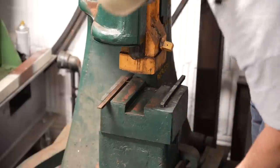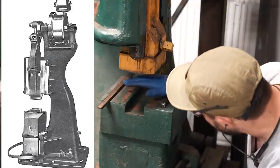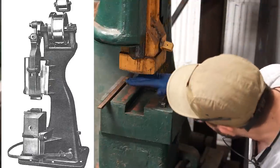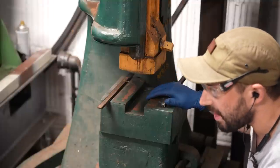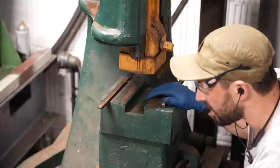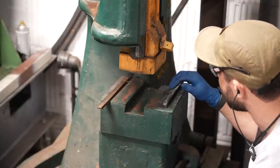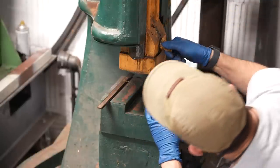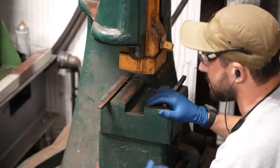That's all the way at the bottom. Based on photos I've seen of this machine, the bottom die should probably only be about that tall. I wonder if I could just put a piece of steel in there as a test — put an elevator weight on there and see if I get more striking power out of it. Let's try to get this die out so I can see what it looks like.